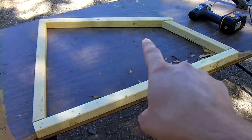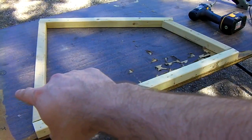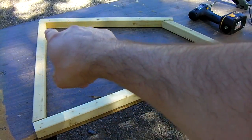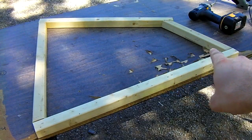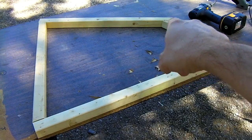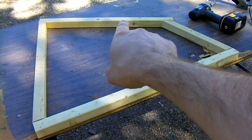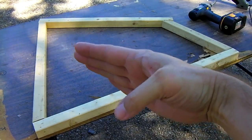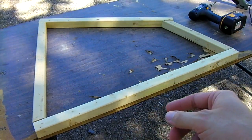This is what each side is going to look like. It's 32 inches on the bottom, 25 and 1/8 inches on the back side, with a 15-degree angle here, a 15-degree angle cut, a 45-degree angle cut here, and the top bar is 25 and 1/4 inches. This is where the solar panel is going to be attached. This specific setup puts the solar panel at a 30-degree tilt angle, which is a good compromise for pretty much anywhere in the Northern Hemisphere.